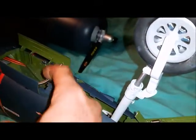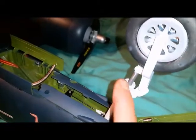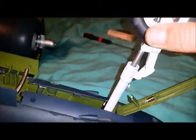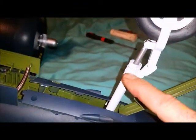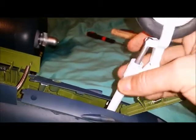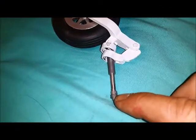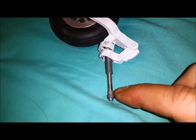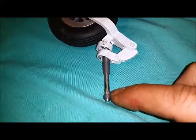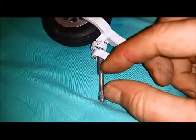So the combination between this, and that piston, which is the big problem when they made these, they've got a design flaw. They need to, if they can fix that, that would be great. That piston just needs to be actually machined a little higher on the shaft. Get these off here. This piston, bottom stopper right here, needs to be up where I have this second one right here. And actually, probably about another 16th of an inch higher, which will limit this travel.